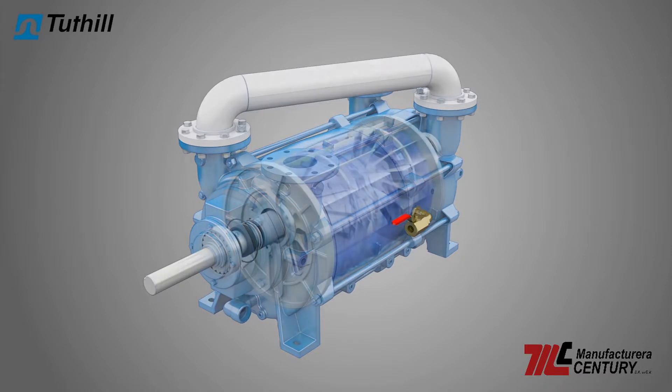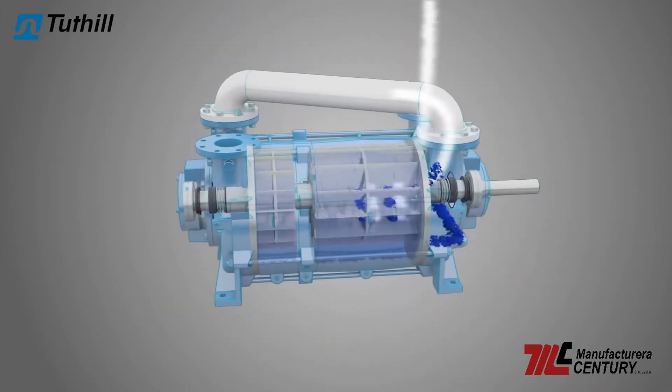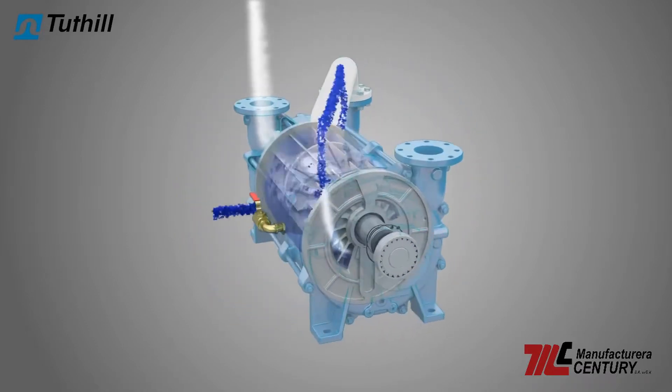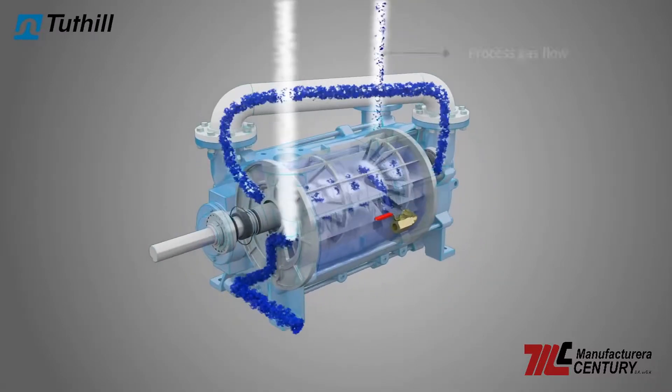The KLRC is a non-pulsating vacuum pump designed to remove gases through the use of its rotating impeller blades that enter and leave a ring of liquid. The impeller forces this sealing liquid to the periphery of the pump casing, where it forms a ring of liquid around a center void.